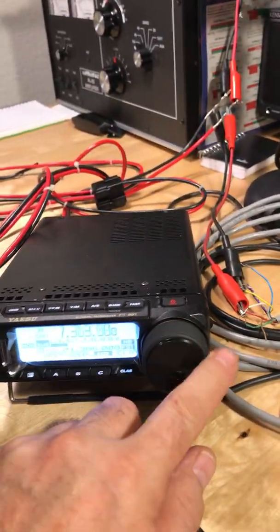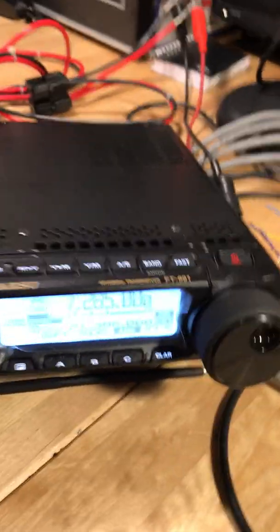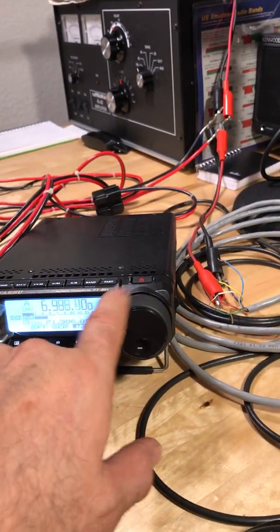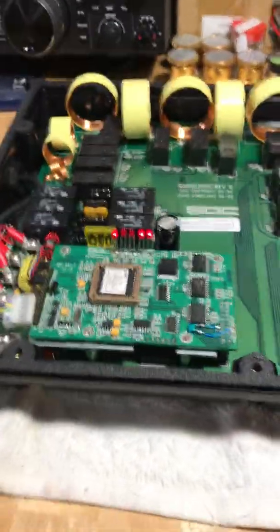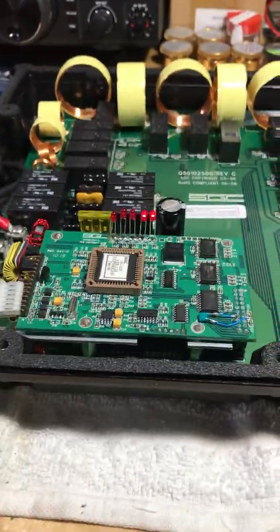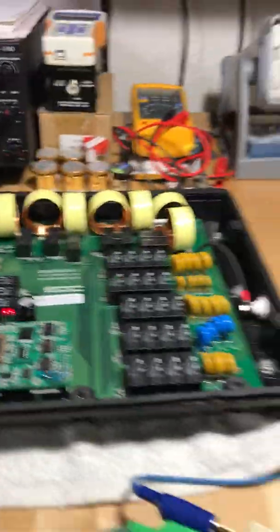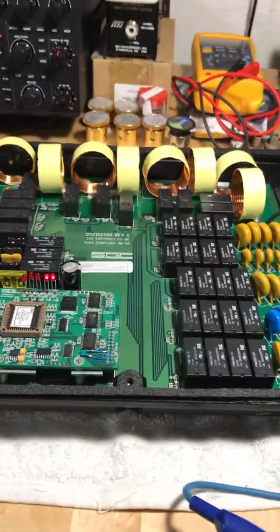I don't know how to delete the memories. Going out of band — the tune it has is actually for a higher frequency, less than 1.5 SWR, bulb is pretty bright, tuner's happy. Going down to the lowest portion on the light bulb load — that shot the SWR up over 3. Thousand one, thousand two, thousand three — it should initiate a new tune but it queried memory again. The correct behavior should be: detect high SWR, immediately query memory, test SWR, and if not good enough, do a full retune. SGC needs to look at that logic, or I just need to accept this thing for what it is.